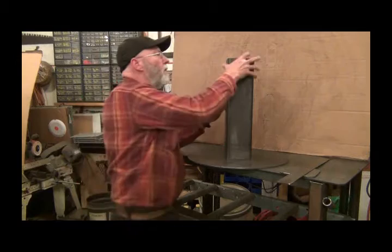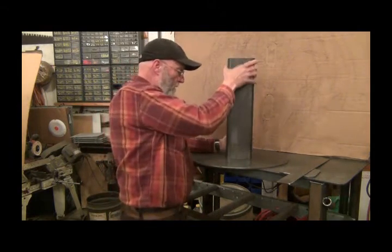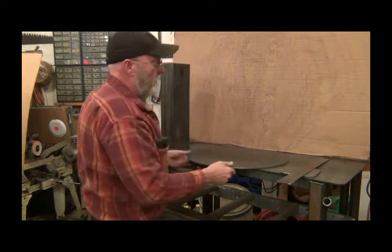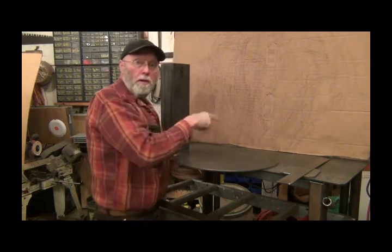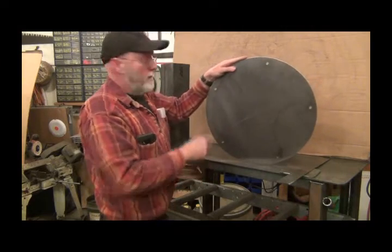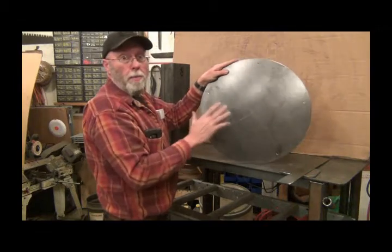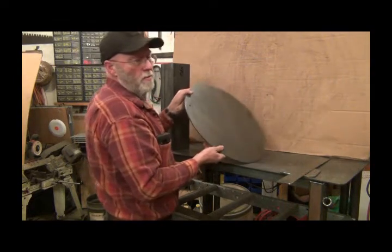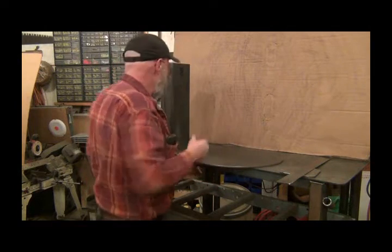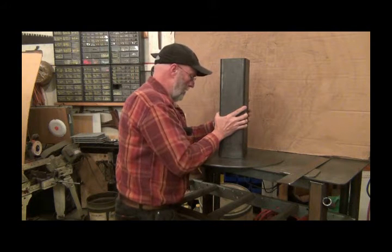What I've got here is a piece of quarter-inch wall five by five tubing. It's cut 20 inches long and I made this great big base for it and I'll weld all the way around it to seal it so it'll hold the oil. I made a 20 inch base and there's five holes around it. I'm going to put it on casters — everything has got to be on casters in my shop so I can move it around. I have the center marked and I have it marked where I want this, so this will be sitting right there in the center.